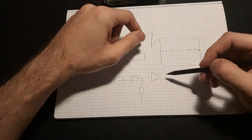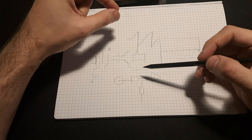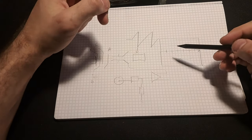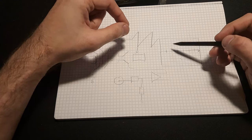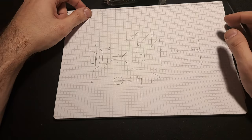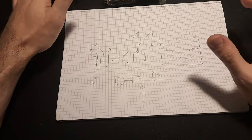You need a differential signal because the vertical plates need to be driven symmetrically but with opposing polarity — so you can control where the trace sits on screen. Driving the plates is essentially like driving a capacitor, so it's quite challenging to do properly.